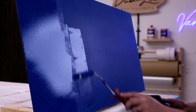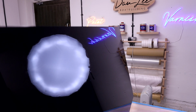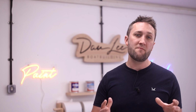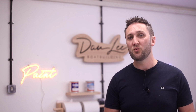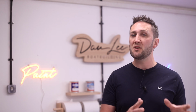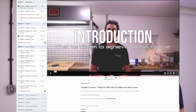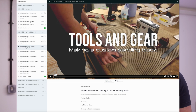Take a look at some of my other video guides in which I cover the techniques for applying various top coat products. So there we go, a versatile and easy to use marine primer that is suitable for a wide range of substrates and all existing painted surfaces. It is compatible with both single and 2-part top coats, so all in all covers most bases for your priming needs around the boatyard.